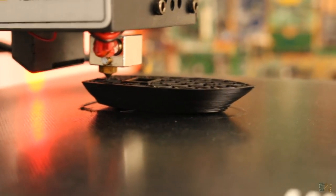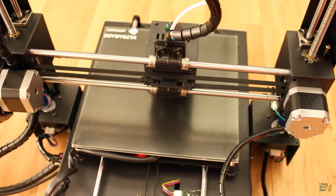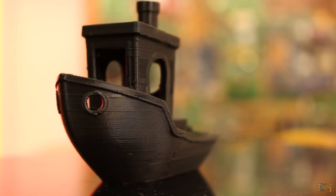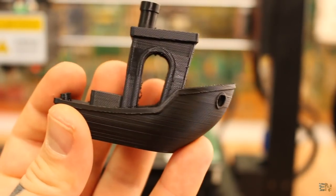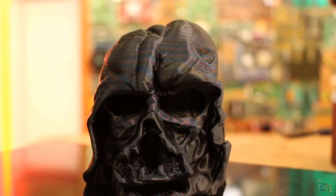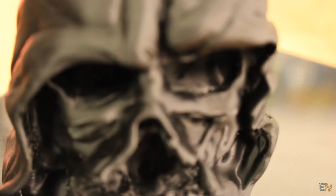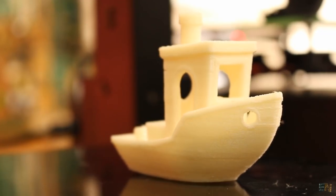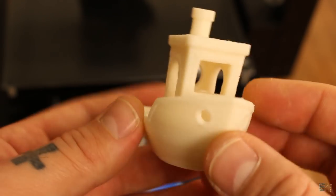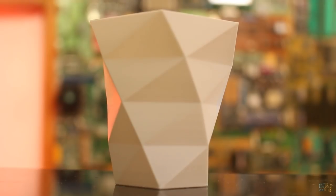So I had to stop the first print since the bed was not hot enough at the beginning and the print didn't stick well to the bed. But then I increased the temperature for the bed and this is the final result for the benchy — I used 0.2mm layer as in my other examples and as you can see, this might be the best result till now. The layers are perfect and the entire benchy looks awesome. I've also printed this amazing melted Darth Vader that I downloaded from Thingiverse — this print turned out great as well. Next I've used some ABS; this white ABS did a good job as well. I can see a bad layer here, but in general for ABS prints this is great. I've also printed this vase using spiral printing and the layer details are perfect — it just looks so good.